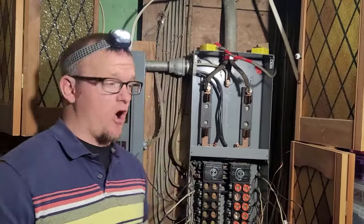I'm slowly working the branches. I've got a lot of circuits I'm capping off that we're going to later convert from 220s into 110s — I always cap them off with some form of tape. I always still land the equipment grounds to the grounding bar, because just in case they were using that for a ground path back for something else, or if there's a fault somewhere in the system, it'll still come back and clear. Oftentimes people will come back and use these wires, and if the equipment ground isn't already hooked up, they may not go through the pains to find it, and you'll end up with an open ground situation.